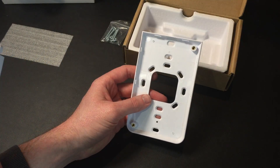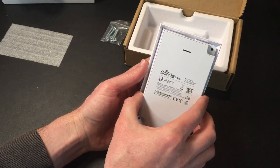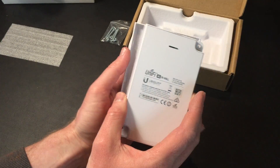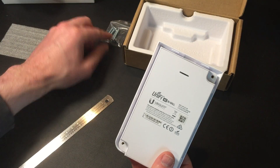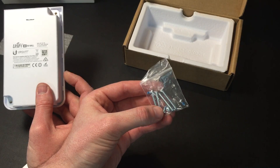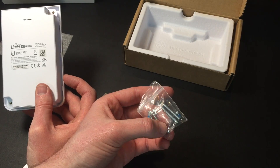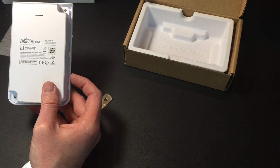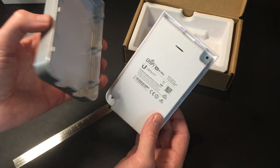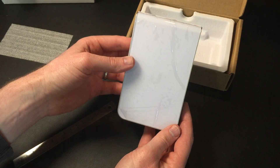So that's the general idea for installation. You make a big enough hole here, you mount it up against the wall, your cable comes through, and you plug in there. Pop that on there. The two little screws included in the pack — the ones for mounting onto the mount — there are two types: a standard Phillips and a security type as well. So if you've got a security screwdriver you could use those instead. And that fits on there, and then when you're happy, this cover just clips on top — just like that — and then that's up against the wall.